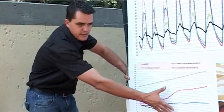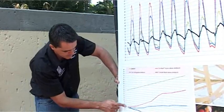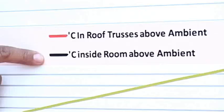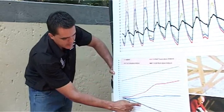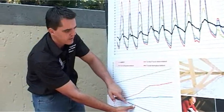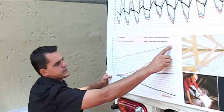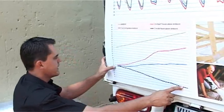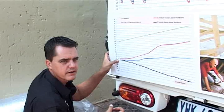As a summary, this graph clearly shows the effect of the roof insulation. This is our baseline — the ambient temperature outside. At 20 degrees, the roof top is about 4 degrees warmer, ceiling level is about 3 degrees warmer, and the inside of the house is also about 3 degrees warmer than ambient. At 26 degrees is where we find our baseline — when it's 26 degrees outside, it's 26 degrees inside. But as soon as it gets warmer than 26, the insulation starts doing its job. When the outside temperature is at about 32 degrees, your inside temperature is 6 degrees colder than ambient. And in winter, as soon as you go below 20 degrees, your inside temperature actually starts going up, because you're retaining all that heat inside the house.